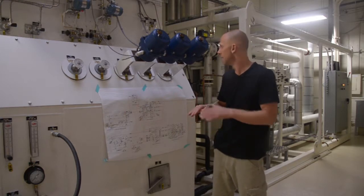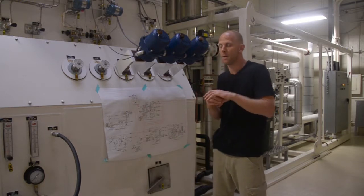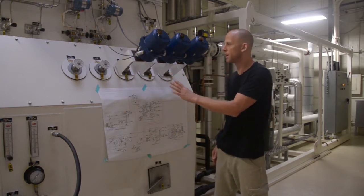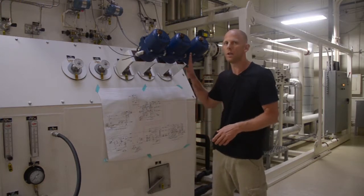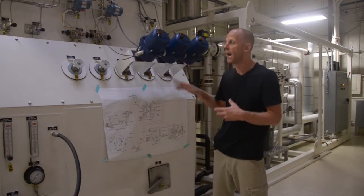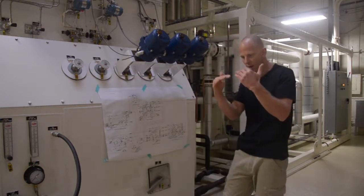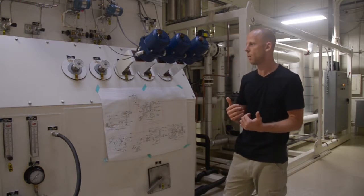In oxygen mode, the level of the oxygen bath and therefore the amount of oxygen being drawn out of the column is automatically controlled. So we don't manually control that in the way we do in nitrogen mode. In oxygen mode, if you're struggling to find purity, generally you would put more air to the column to allow your purity to improve, and you would monitor your waste purity and control your pure nitrogen feed to bring that waste purity down. In other words, to prevent too much oxygen escaping from the waste.